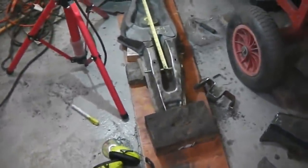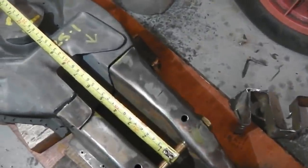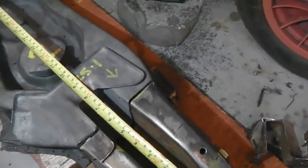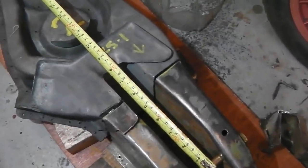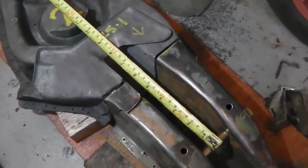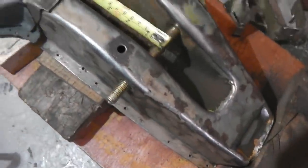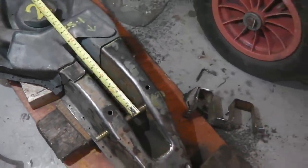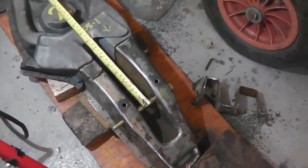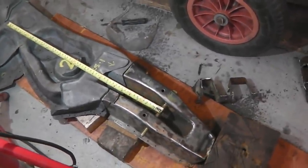Alright, cut, shut, lined up on the block, and our measurement back is 25.1. You'll see there's a reasonable gap to fill. It's very difficult to get a totally flush fit with it, so I've chopped either end and got that measurement back there. We've also got some extra measurements with the curve, the radius of the curve. I've taken them so that when we lay it on the floor I can take measurement points. So a couple of measurements, a little mini jig formed.